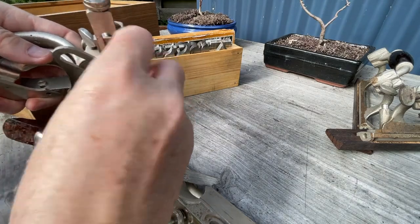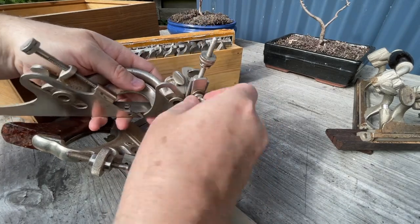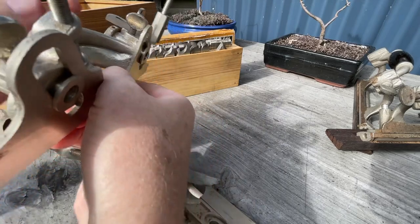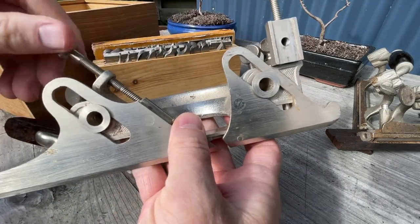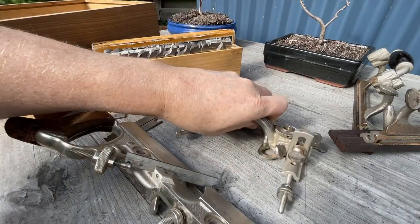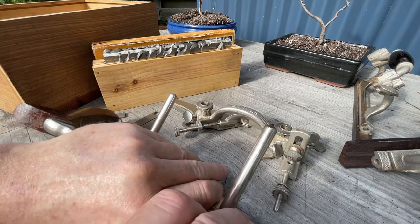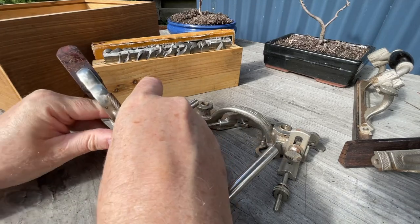With the 55 — I'll just get this depth stop out of the way — you'll note that it has these slots. What these slots do is enable the whole mechanism to be screwed with the angle screw at the top, up and down those slots, enabling this skate to be at a different height to your primary skate. So we grab a couple of short bars, slide them in, and loosely tighten those down just enough to demonstrate what we're talking about.